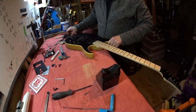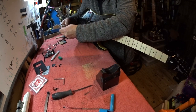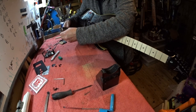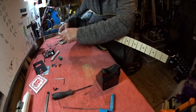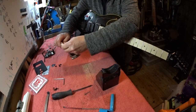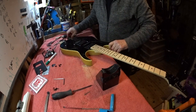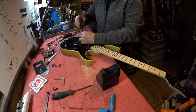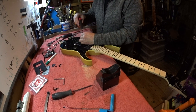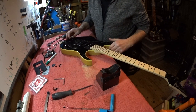Still doing it. Thankfully, that means we've got room for the adjustment. So half plus a quarter, that's what we've done. Brings us to 5.12. Okay, that's close enough. It's a tiny bit under. So we know now that on this side we want to do a half and a quarter turn. Half, quarter. Ta-da! It's all like that. Now we're ready to reassemble.